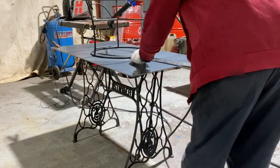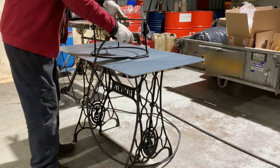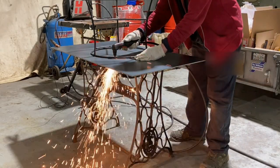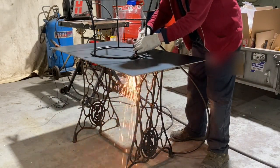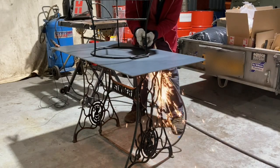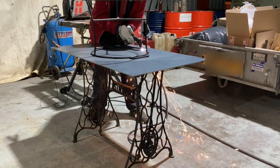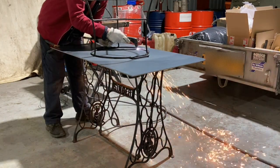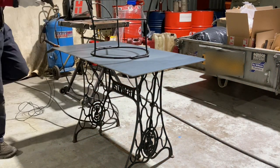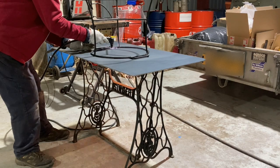I'm going to take lots of measurements here just to centre this up and square it up — it takes a few minutes. I'm going to take lots of dry runs of the plasma cutter, unsnake the cable, then take some more dry runs and then get going. The more stable I can make my hands and body, and the more smoothly I can move, the better the cut quality is going to be. Eventually I settled on just resting one hand on the table and dragging along slowly.